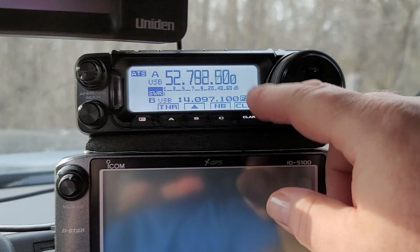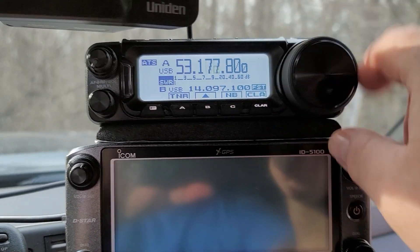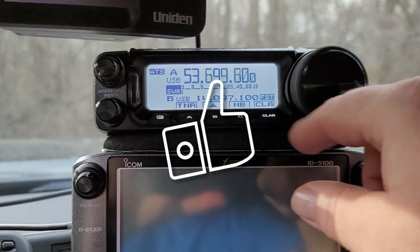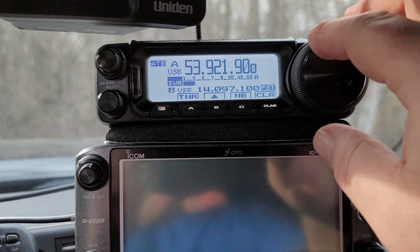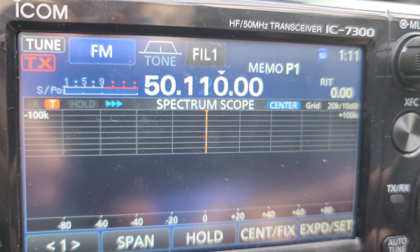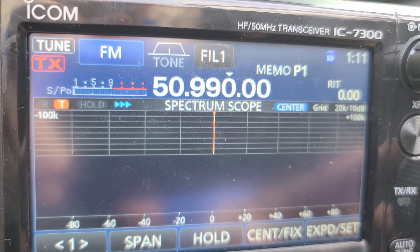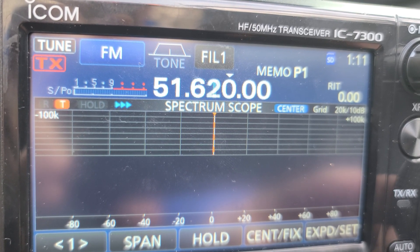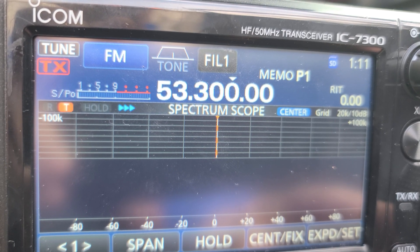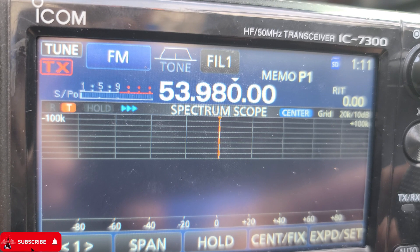It's a pretty wide band here. Now here I am starting at the bottom of the band — keep an eye on the waterfall. We're looking at regular intervals for banding that usually indicates some type of interference or EMI — electrical magnetic interference — and we're just not seeing any. Of course I'm going through this fast, but the waterfall, if there was something there, would show it to us. And just not much there, if anything. I was quite happy with it.